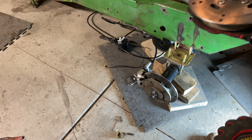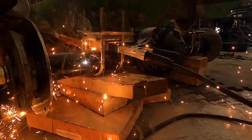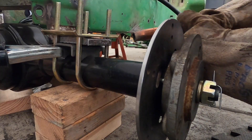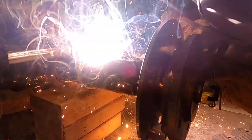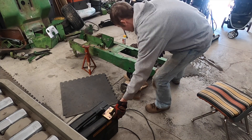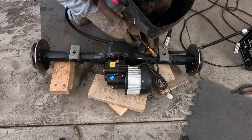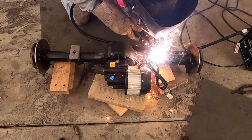Once I had the hubs all figured out and mounted, it was time to use all the hardware that came with the axle to finalize and weld up the brackets. This was not too difficult, but while placing and mounting it I had to be sure everything was aligned perfectly, because I didn't want to weld it all up and then realize it wasn't aligned. I took a lot of time aligning it, tacked on the metal brackets it came with, triple-checked the alignment, then went ahead and fully welded them on.